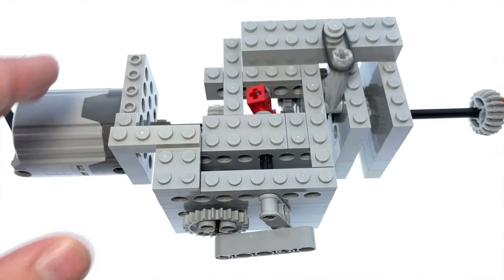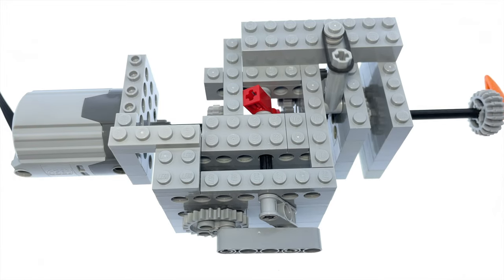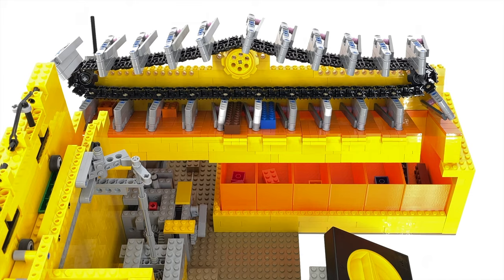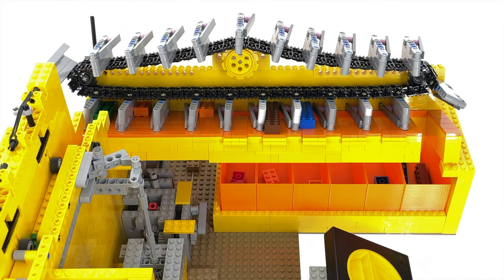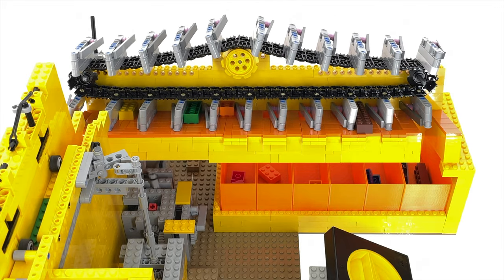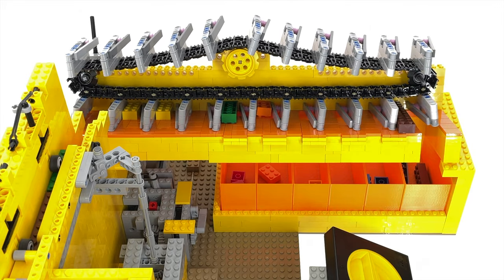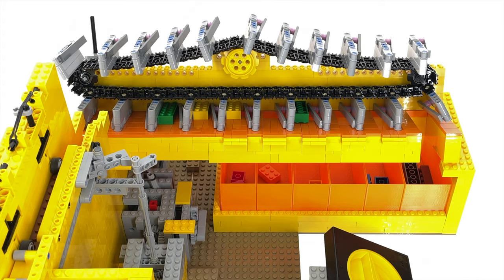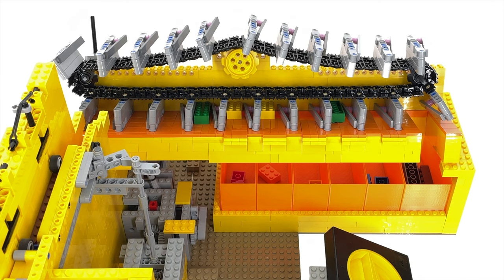It's set up so that right after the chain belt thing stops, it releases a brick, ensuring that it has plenty of time to slide down into place. You can see that exact thing happen here. Right after the belt chain thing that moves the bricks along stops, the separator lever is activated, giving plenty of time for the brick to fall down. If the separator lever was activated any later, or even sooner for that matter, a jam could happen.